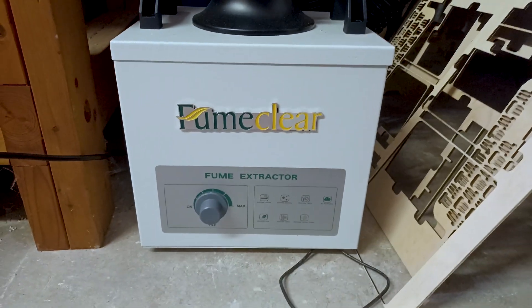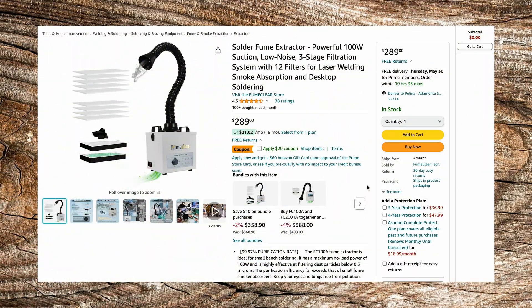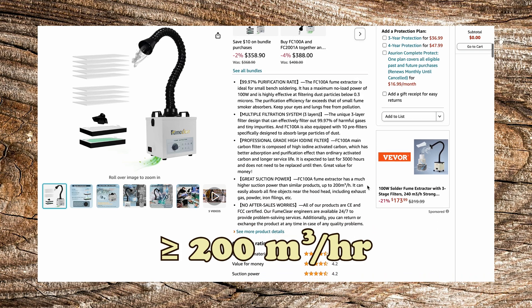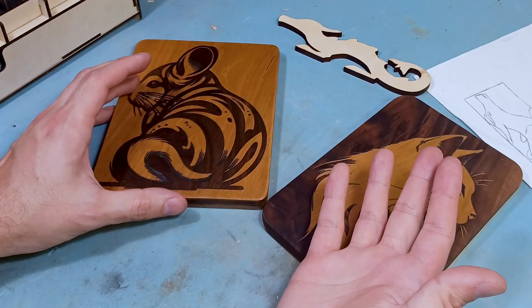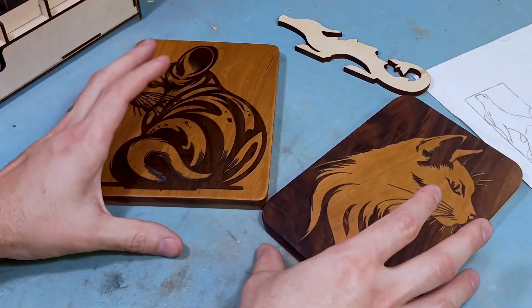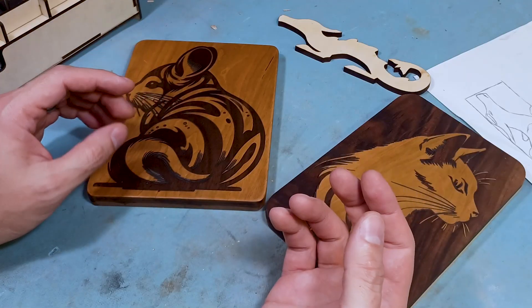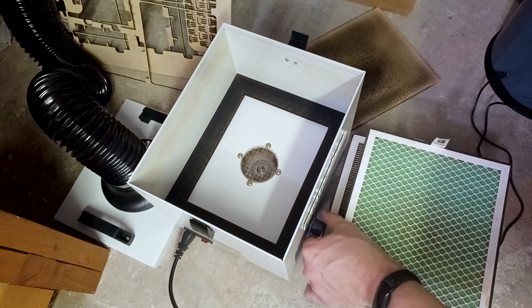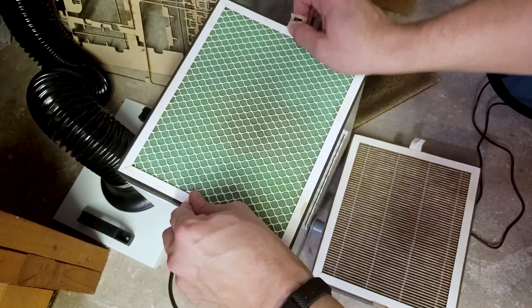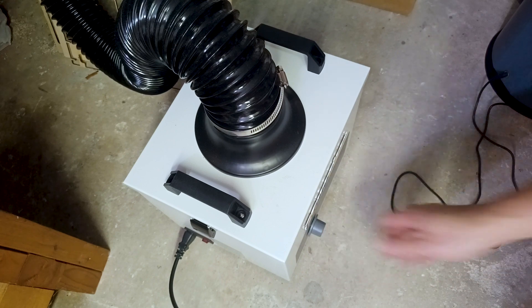Next is the smoke filter. Wood is organic material and once it burns, it smokes, so lasers are going to create a lot of smoke. You will absolutely need a good fume extractor. Anything with a flow rate of like 200 cubic meters per hour or 117 cubic feet per minute of airflow will suffice. You want that suction to pull the air out. My original smoke filter would work, but I had to wait about 10 minutes for the smoke to filter out, and it leaked smoke into my garage, so I had to upgrade to something more powerful. Good filters will have a fan or turbine that pulls air through the system, not pushes it through. I'll have the one I use linked in the comments below.